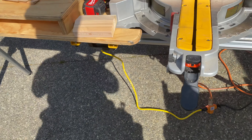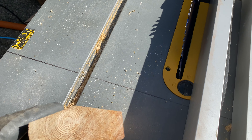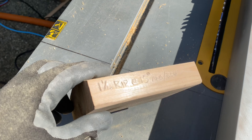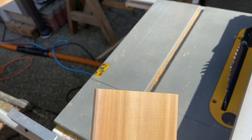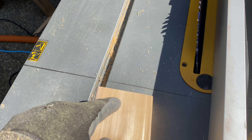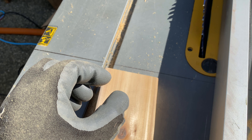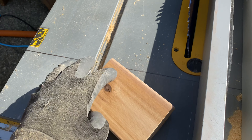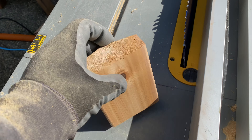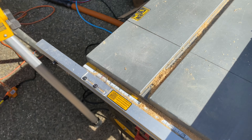I started off like this: cut off a piece, make a pattern, write down what you did — that's my first template. I'm thinking of taking a cordless router with one of those flat bits and a guide, cleaning out from both sides, and leaving myself an inch and a half by an eighth, so it'll sit right on there. I'm going to go try that now.